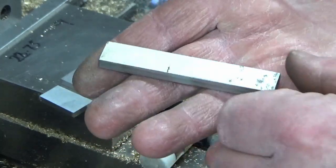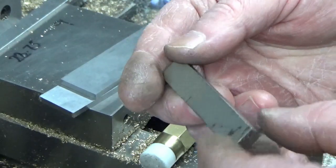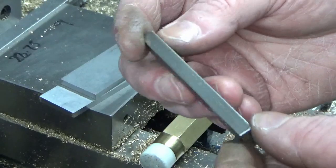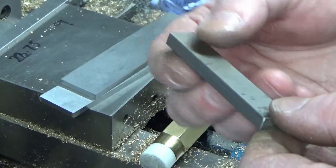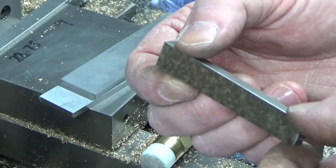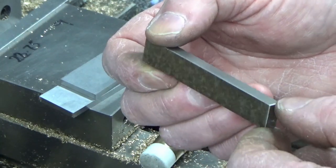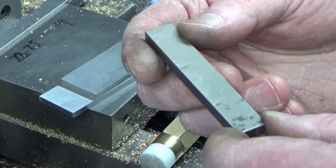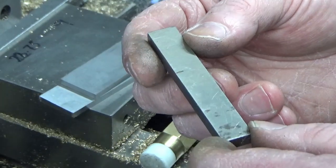So guys, onto the Conrod. So I've got myself a piece of 01 or ground flat stock or silver steel or whatever you want to call it, gauge plate, many names for the same thing. It's 6mm thick, needs to come down to 5mm, and I need to block it out this way as well for my biggest end. There's a big end and a small end, and they are different. So I'll do that off camera because that's just plain straightforward milling, and I'll bring you back when we're getting into the meaty bit of the Conrod manufacture.